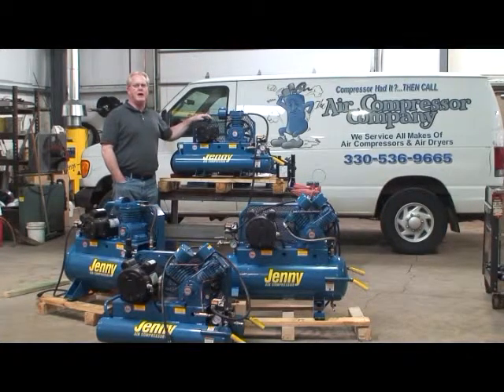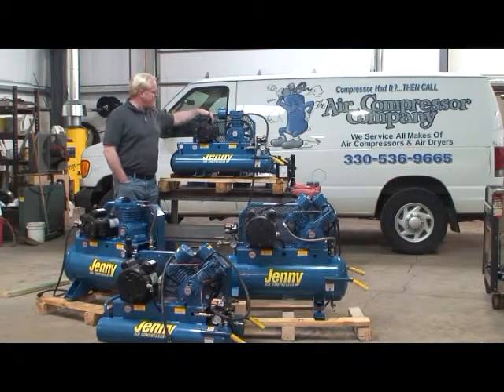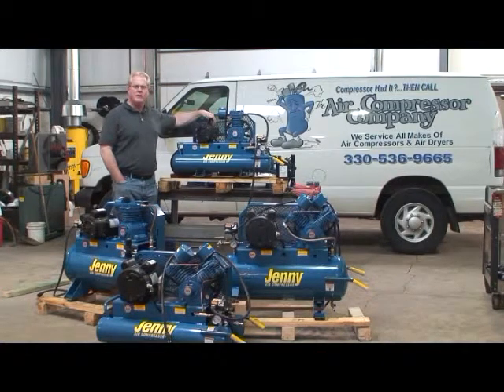There's still the amperage that needs to be delivered to the motor as well. Located on the tag on any electric motor is the voltage requirement as well as an amperage requirement for that motor running in both an unloaded and loaded state. If your electric motor is pulling more amps than plus or minus 10%, you're outside the service factor and you need to make necessary adjustments to bring your amperage down.